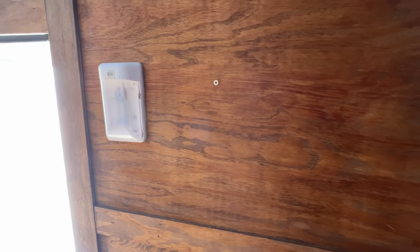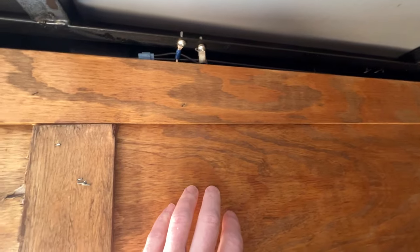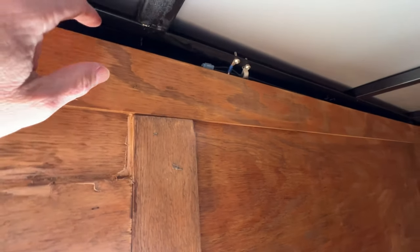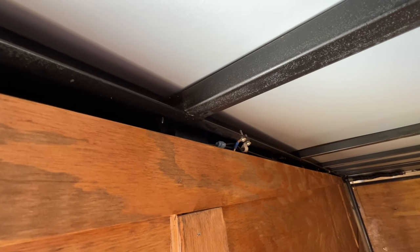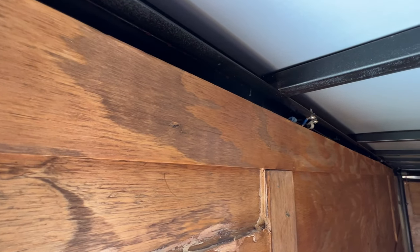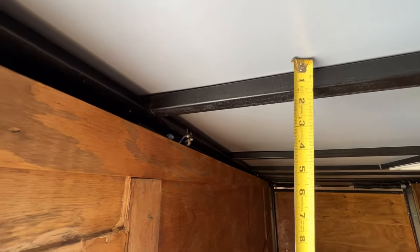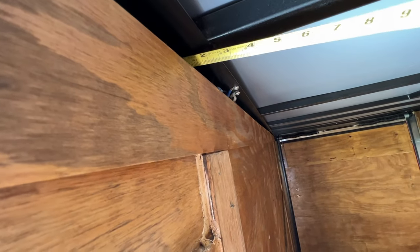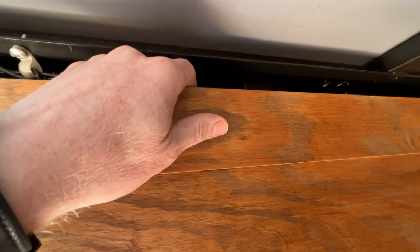And rather than surface mounting that switch, like I said, I have an idea, because this plywood skin is mounted to rectangular tubing or square tubing, depending, and the tubing that makes up this trailer looks to be 1 inch square. At least that's what the roof members are. The walls also look to be 1 inch. So that means I have a 1 inch cavity behind the wall.